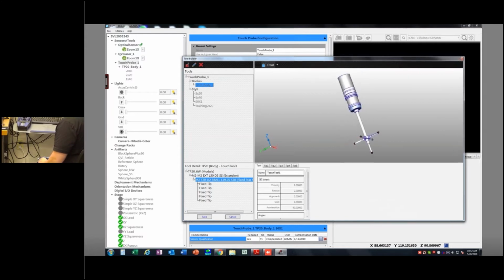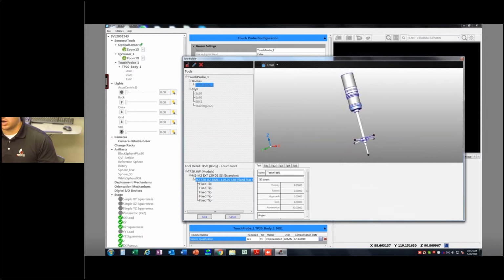Again, if I wasn't certain, I could just use my actual part number to determine that as well. The other thing about star styli that I might as well touch base on is there's little holes, kind of keyway holes, in the cylinders of these different styli. Okay, they are the same size as a paperclip, but they also come with a little tool that you can use, but the tools get lost and then you can use a paperclip. So there's one right at the base of this extension to tighten that down, so I can put the paperclip through and turn it to tighten it. But in these particular stars, it's this probe that locks down this fixed star on here. So this star can spin, it gets locked down by this bottom probe here. That threads up into the extension and kind of hugs this star here and locks it down.